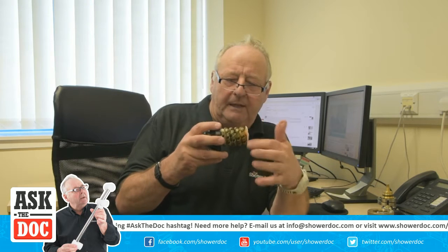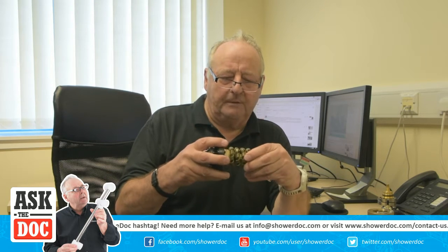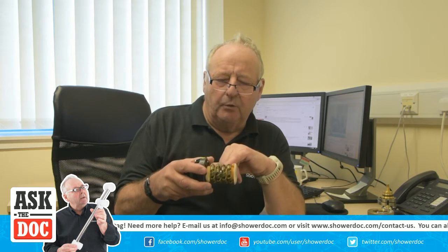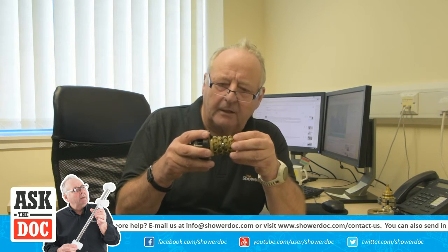Just another way of doing it — this is an Aqualisa, and it's an old one. The bimetallic strip is coiled in this case, which means it moves in and out, with the ports inside here. That way it can keep the temperature fairly accurately balanced as well.